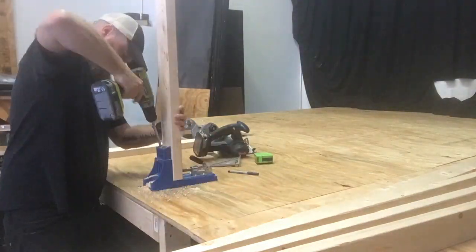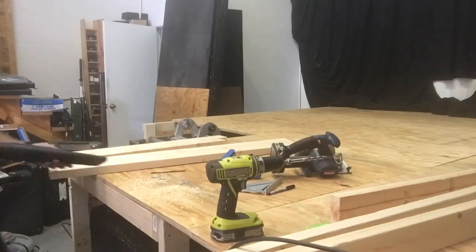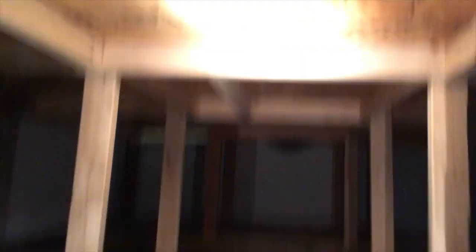So a whole bunch of these things — pocket hold them all in — and I've got some footage coming up of me crawling around underneath the stage. There's the seam right there. So each one of those I basically had to put another 2x4 underneath so they could have something to grab into, and it also makes the stage a lot more sturdy. It was a task to climb around. I'm actually surprised I got so much footage from underneath because it was — move a flashlight, move the camera, put up the framing — it was a tough process, but made it.